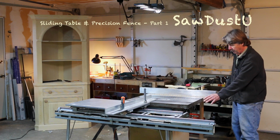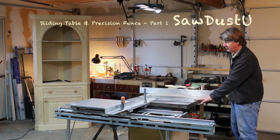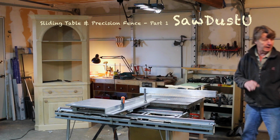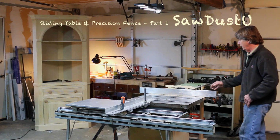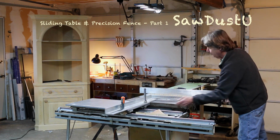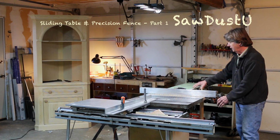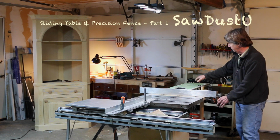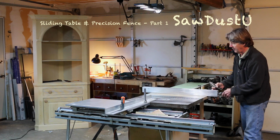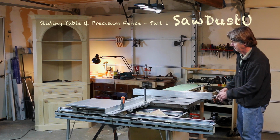It's all bolted and screwed together and with wood components so that the side table becomes integral to the table saw. Now, let me get this hold down out of the way. You'll see here, this is the same sort of rails that we had over there with the sliding table, only this time the rails are sitting on top of the guide blocks, and you can see the fence here glides back and forth like that on those rails, locks in place with one finger. It's a really nice system.